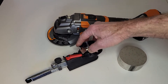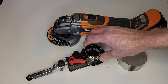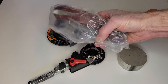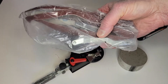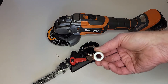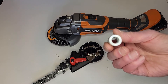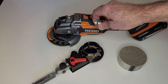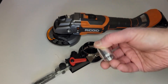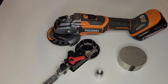These are relatively inexpensive kits. I think I purchased my last six on Amazon for probably $20 a piece for the entire kit, which includes the head, a couple of additional wheels in different shapes, some extra belts, and the driving drum which goes on the bottom of the angle grinder. Although this is not threaded correctly for an American angle grinder — an American angle grinder takes 5/8-11 threads. This is some kind of 10 or 12 millimeter metric thread. Either way, this has to be rethreaded to go on the angle grinder. We'll show you how we do that when we do the lathe work.